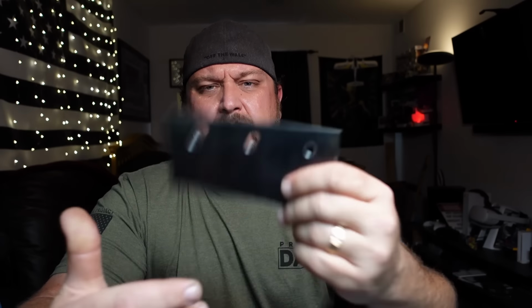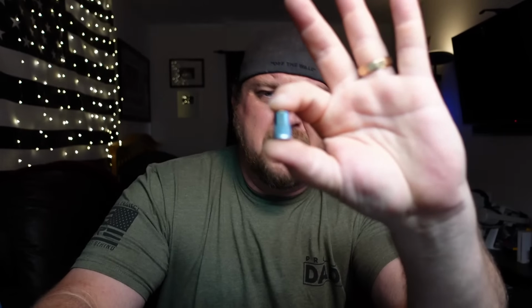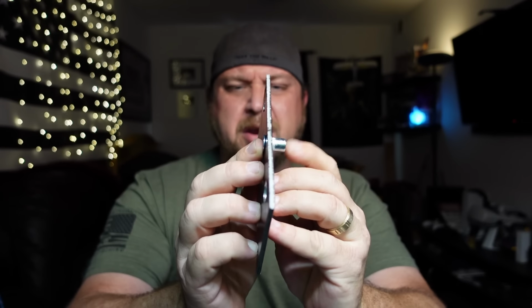You have another choice, which would be a speed nut, those clip-on nuts that go on the sheet metal. They stink because you usually get one or two uses and then the thing breaks. Or what my preferred method would be, a rivet nut. People call these nut certs, riv nuts. All of them basically apply to this, and it's basically a threaded cylinder that you put inside the right hole there. You crimp it down, and then it pinches onto your piece of sheet metal, and now you've got a piece of threaded sheet metal.